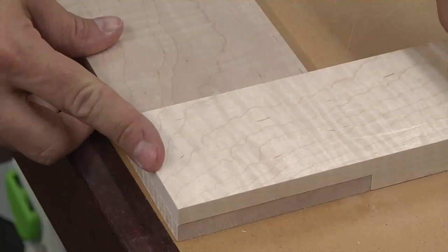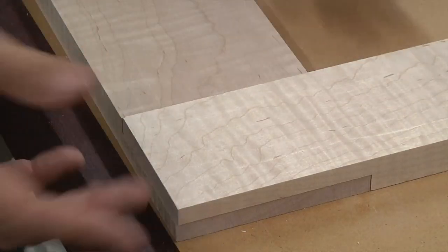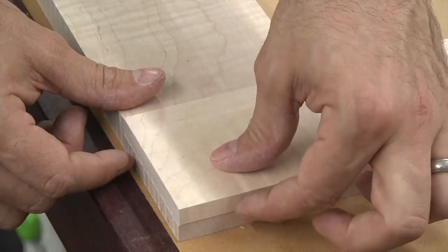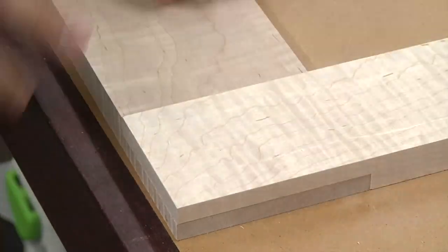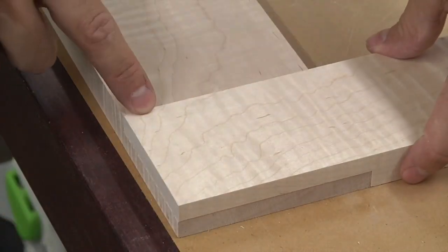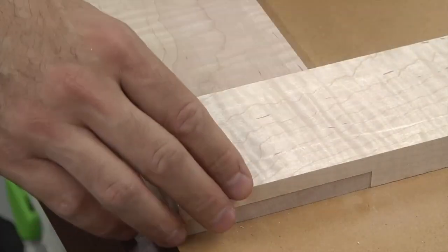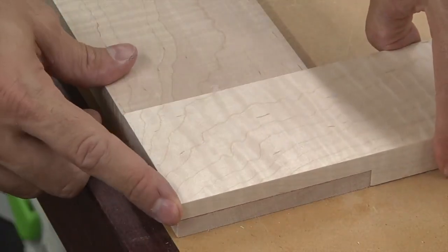Examine all four of your joints and make sure everything fits together the way you want. You should have a pretty gap-free joint on the face. The underside is less important because you're not going to see it, but it should be nice and flush. If you followed my instructions, you'll notice the side piece sits proud — you can feel a little bit of a lip — and the same with the top piece being a little proud of the end grain. This is absolutely intentional: when we clamp this together, we need pressure to close up the shoulder areas, so we leave a little extra stock that we can plane away later, and that's going to help us with clamping.